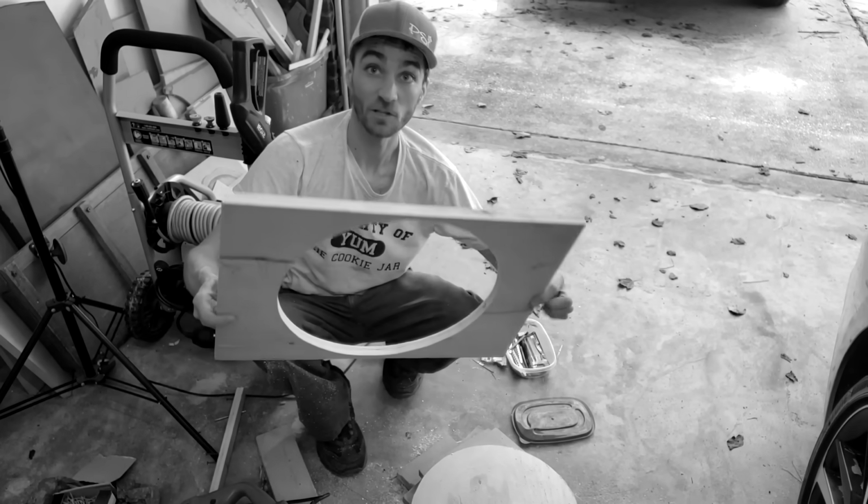This project was purely for fun and very spontaneous. One day we just came up with the idea, he came over and we basically just whipped it up. I know there's people out there that build extravagant boxes with curves and make it look fancy, but this was just a nice simple project that anybody could do. We didn't really want to go extravagant with it. Show you that you can use easy tools like jigsaws and free apps to make a box that sounds pretty damn good. And the first initial results, I was very happy and Wesley was blown away. I couldn't be any more thrilled with the results. We are actually gonna be tailoring and dialing in the system even more down the road. Like how we mentioned in the beginning of this video, we oversize things so we can get that perfect sweet spot by taking away volume slowly.